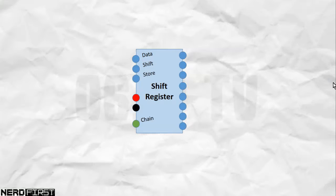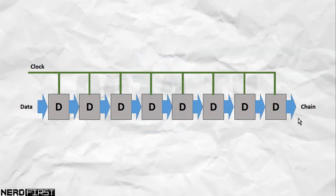Finally we can look at our most optimized solution, which makes use of just two shift registers. To achieve this we take a look at a pin we've not really used before - the pin for chaining. To understand how this works we need to go back to the diagram that explains how a shift register works. Think of it as a bunch of flip-flops sharing a single clock signal. Whatever data you have gets pushed forward from one D flip-flop to the other based on a clock pulse until it pops out at the end.